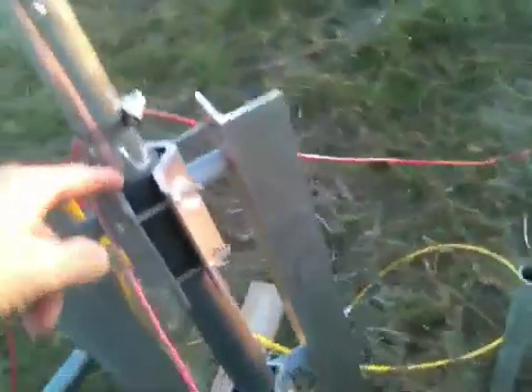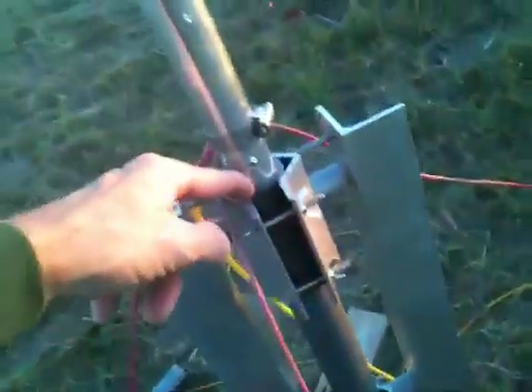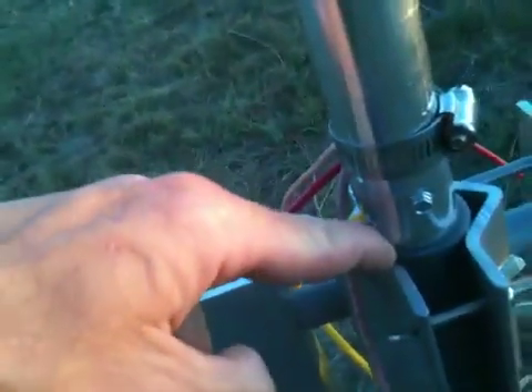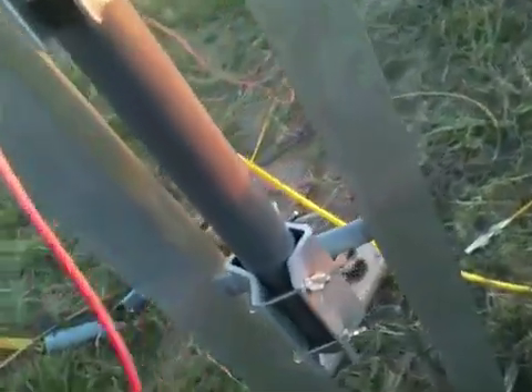It's a pretty nice design. The pole slips down inside here and it has the double wall, so the double wall sits right on here — you don't have to worry about anything else. It's clamped down. Really nice design. As you can see, it's kind of wallered out a little bit, and it's leaning — definitely leaning. So once I get it hammered in the way it's supposed to be, I'll put some guys above the center insulator this time. I will not screw myself.